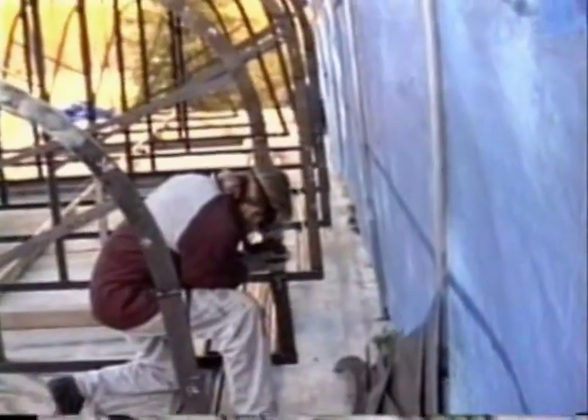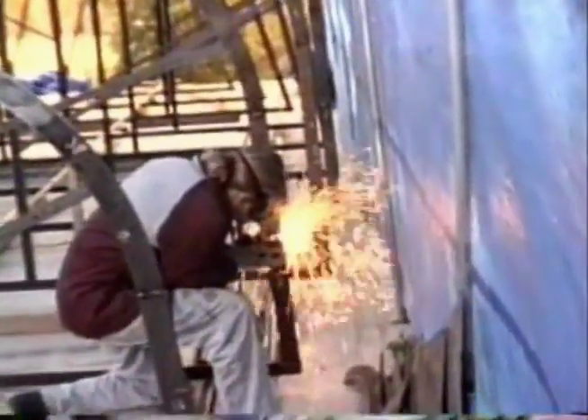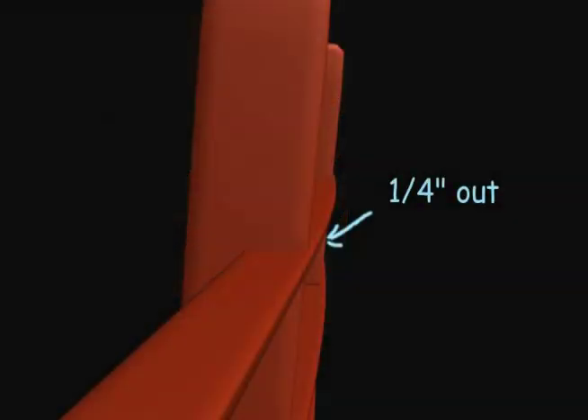The next morning started out a little rough, but we were determined to start serving up some stringers. No, I don't mean spaghetti for dinner. Stringers are like little sub-frames that run from forward to aft. They attach to the frames via slots, but are left to stand proud. This keeps the hull plate off of the frame and prevents the starved cow look.